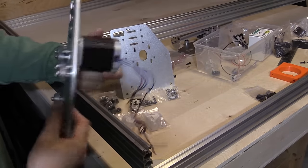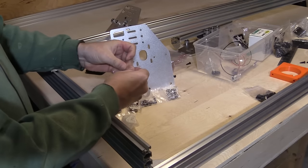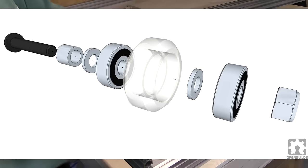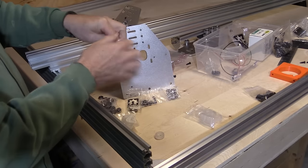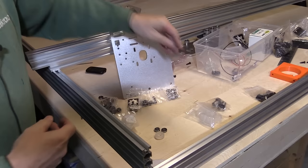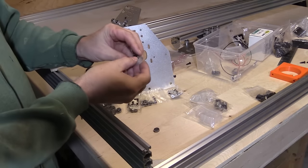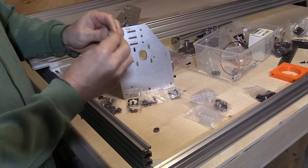When you buy the wheels, they come as a kit with separate items. You have to assemble the wheels first. You've got the outer parts of the wheels, and you need two bearings to go in them — you get all these as a kit when you buy the wheels. You push the first bearing into one side — they're a very tight fit, so you may need to use a pair of pliers to get it in. Then you take the other one and put it on the other side. In the middle between the two, you need to put a precision shim.